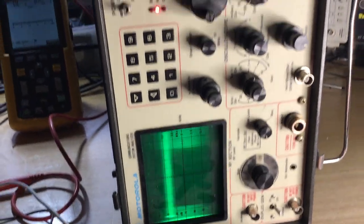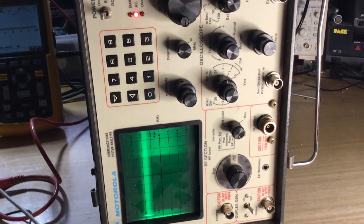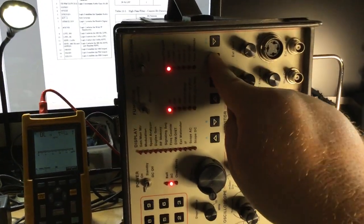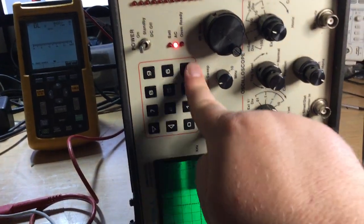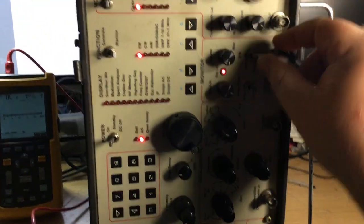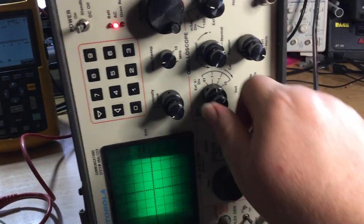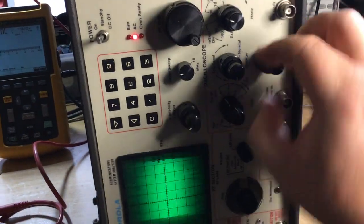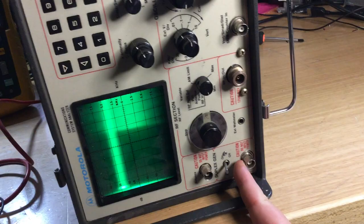Powering the test set up now to do the voltage measurements. I've noticed the display seems to be doing something it wasn't doing before — just shows the intermittent nature of the fault. Pressing the buttons does nothing, doesn't change the LEDs, no operation at all no matter what control you use or what button you press. It does seem like a power supply fault, although we don't know for certain yet. At least the HT is running on the CRT, but there's no other operation.